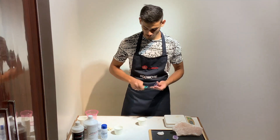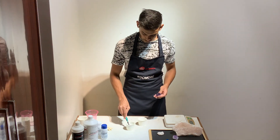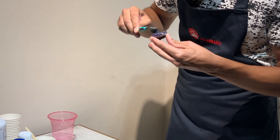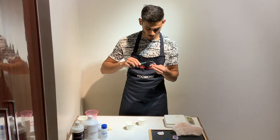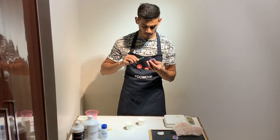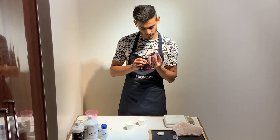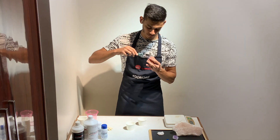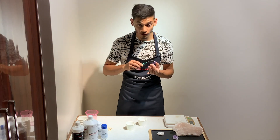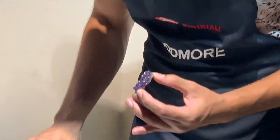I've tested that it fits. Now what I'm simply going to do is take some of this silicone on the toothbrush and just brush the top of the crystal. What this ensures is that when there's a thin coat of silicone applied on the surface, the air bubbles rise up and break quite easily compared to a thicker pour. Just applying this light coat all over the piece ensures we're going to get fewer air bubbles. You can see the air bubbles are actually bursting on their own.